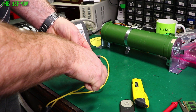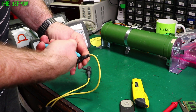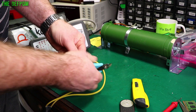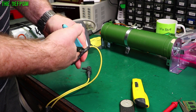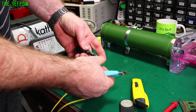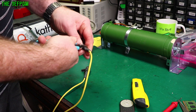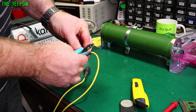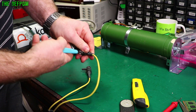I can see it's moving, so it's going to be this one. I've added a playlist at the end, so check that out if you want to see more of these videos. Just trying to cut through this carefully because there's a rubber sleeve inside which I don't want to damage — that's the actual water seal. This is the strain relief, and they don't strain relieve very well because they're too stiff, so the wires break right here at the end of the relief — which makes it kind of pointless.